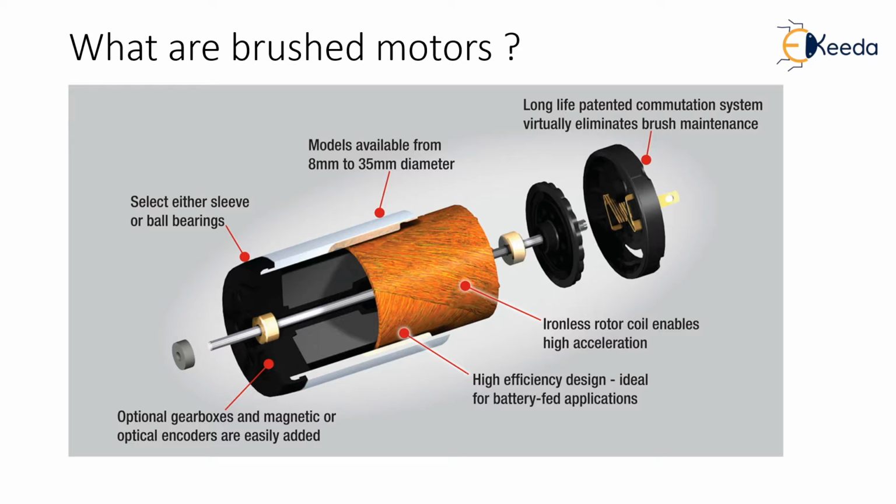Although efficiency of the system is reduced due to the greater thermal insulation of the internal mechanics, it is possible to reverse the rotation direction of the motor by inverting the polarity of the DC power output. Due to the contact of the brushes with the commutator, longevity of the brushed motor is greatly reduced in comparison to the brushless motor. In terms of application, a brushed motor is better suited for micro class multicopters. Their small size, low weight, and simple driving techniques improve their suitability for micro drone flight.